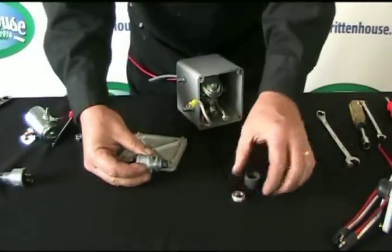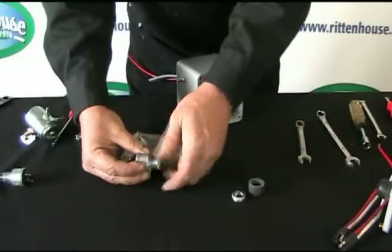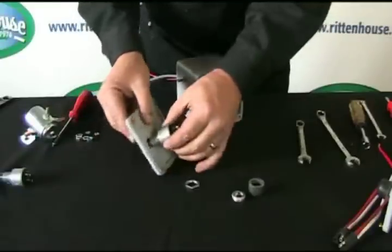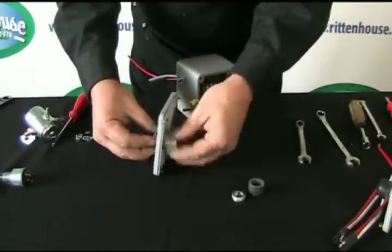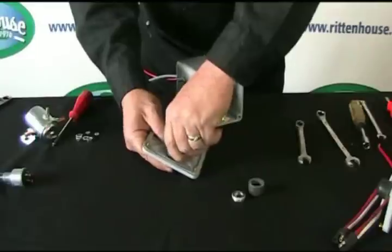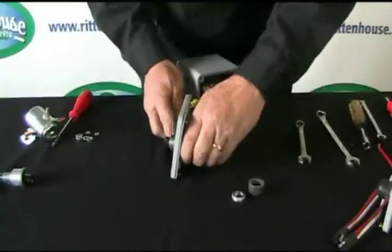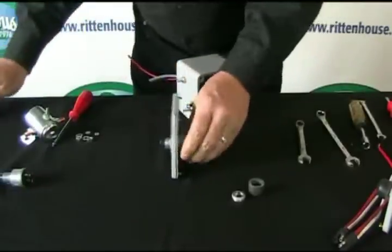It consists of the holding nut for the boot, the nut that locks this back into the plate, and the 2 screws for your wires. Okay, we got it this far. Of course, just push this back through the hole. Throw the holding nut on and just turn the whole thing. One thing I want to tell you is to try and get the 2 nuts to line up that way on there so that it does not touch any of the metal parts inside the box. Once you get it there, take your adjustable wrench, snug it up so it doesn't move.